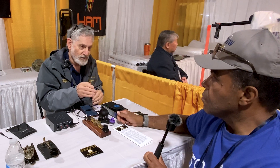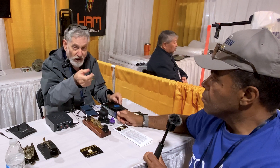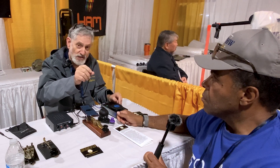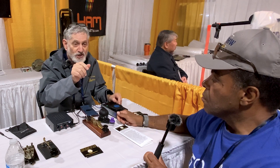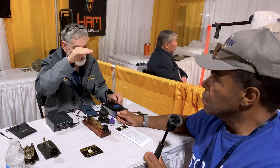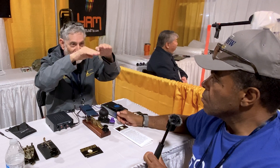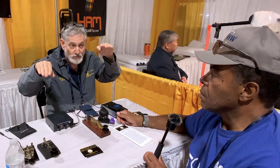At that point the frequency is good. Adjust the sensitivity all the way down until it no longer hears the signal of interest, then bring it up until it's registering cleanly — just registering cleanly. What you're trying to do is get that CW signal just above the threshold to detect cleanly, but all the other noise stays below. That's pretty much the optimal tuning.